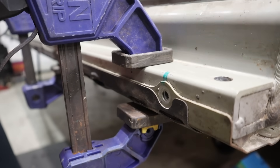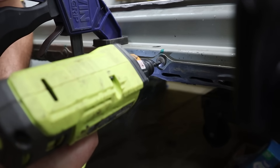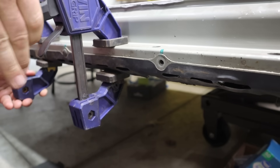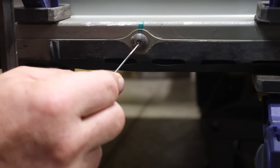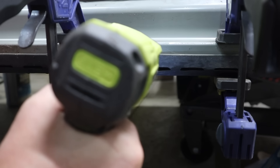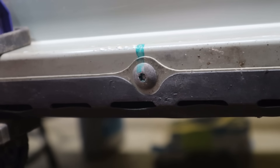And I can already see corrosion on there. I've got a speed clamp on either side of the screw as I pull it out. Then I'll just move the first clamp down to the next section before I pull the next one out. This one has some dirt in there, so I'm going to pick that out to make sure my bit can fully seat in the screw. Then I'll take the clamp, move it down to the other side of the next one, and just keep doing this all the way down.